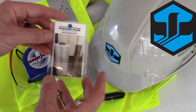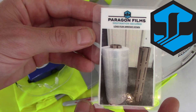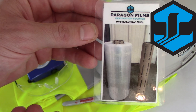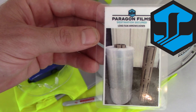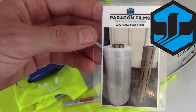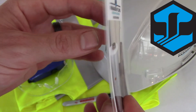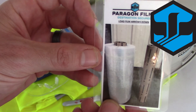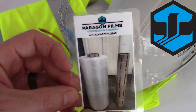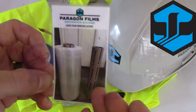One of my favorite things I love to leave behind after a film analysis is a friendly reminder from Paragon Films on how to properly load our rolls of film — whether it's arrows down or arrows up. It's critical to know where the cling is with Paragon's films. We always have the cling on the inside, but not every manufacturer loads their roll the same way. For us it's either arrows up or arrows down based on which way your equipment is rotating. This is just one of those friendly reminders to ensure that everybody using your equipment is loading our film properly.